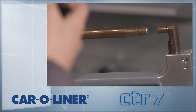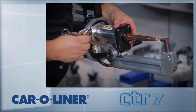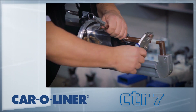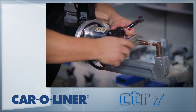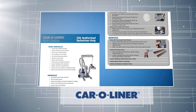Once the caps become damaged, they must be replaced. The caps are press-fit on the cap holder. To remove the cap, place a 17mm wrench on the holder, clamp the cap with vise grips, and give a quick quarter turn in either direction. Place the new cap onto the electrode and tap to seal. The welder will press it into place with the first weld. Refer to the owner's manual for more information.